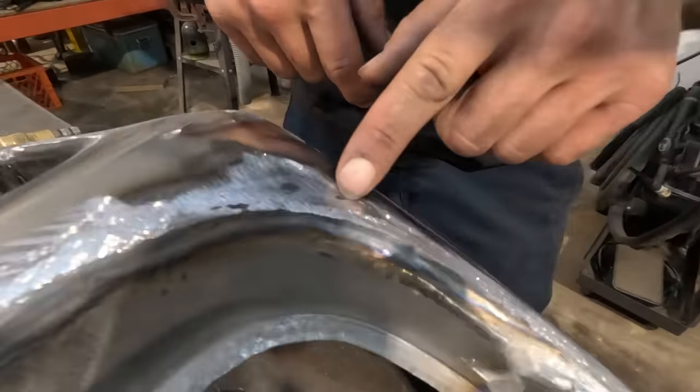So you have to either choose a different dolly for this area or choose a different part of this dolly for this area. This dolly has another curve on it this way, so I'm gonna use it against this area like this. And we'll see if it has enough. Ooh, it might not actually. Nope, that's not gonna work.